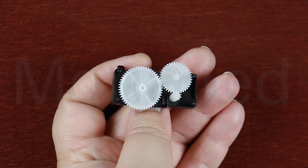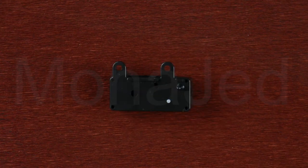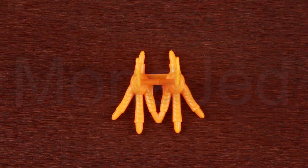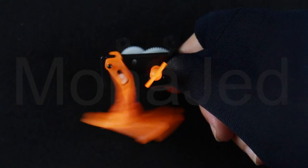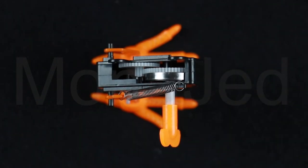It has a set of gears through which the spring's energy is released. The gears control how quickly or slowly a clockwork machine can do things, but they can also control how much force it can produce. And it should have a mechanism the gears drive that makes the device do useful or interesting things. In the case of this toy, it is the tiny jumps of the chick. So I remove the chick and expose the crux of the mechanism.